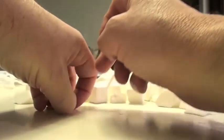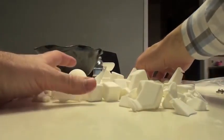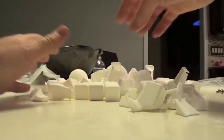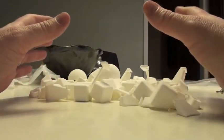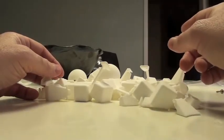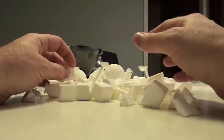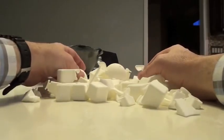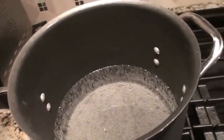The first step is cleaning, because these parts have a lot of powder in them. That powder is residual nylon, and you don't want it there because it will make the dyeing process more irregular and uneven. To clean them, get a pot of water, take it to almost boiling point, put soap in it, then put all the pieces in and let them sit there, stirring occasionally for five minutes. That way they'll be nice and clean and the white powder will be gone.